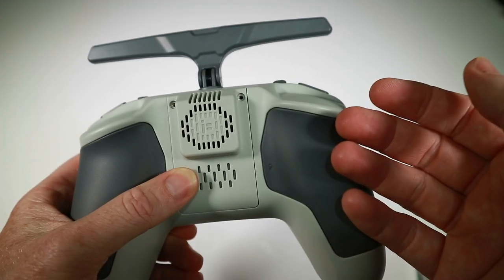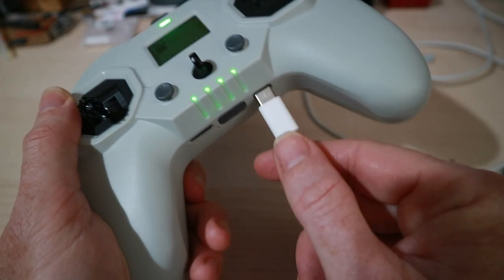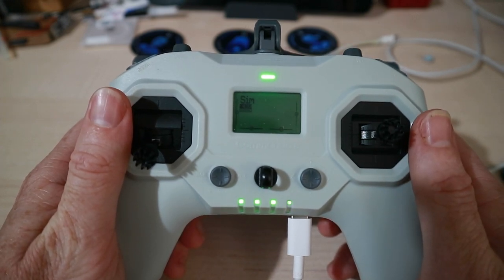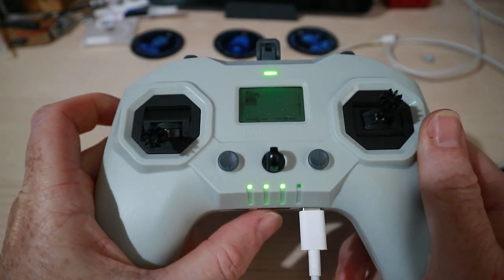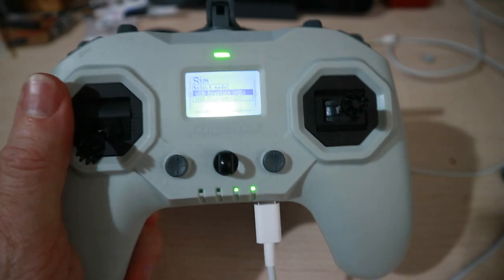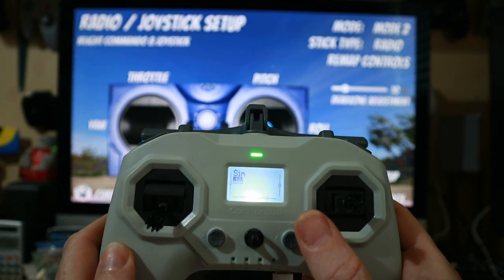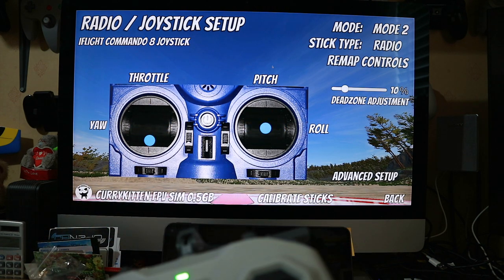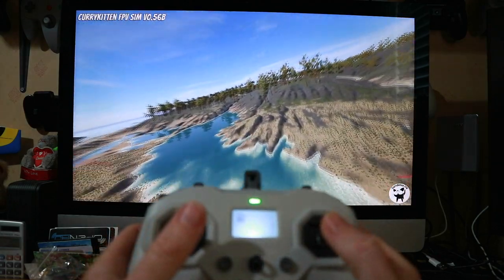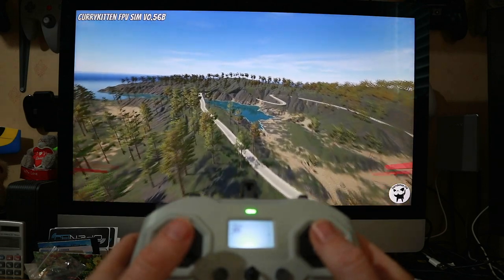Be aware and get the model you actually want to use, because you wouldn't want to keep swapping because it's a lot of work. Another difference is plugging into a computer. Normally with OpenTX radios you turn them on, plug in, and get the prompt about joystick or SD card. Here it goes into charge mode and what you actually do is hold down the power button for a couple of seconds, then it asks the question. My sim is on so I'll go ahead and say I want to use the joystick — that gets detected straight away, no particular problem, and plays pretty well.